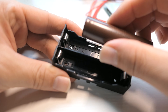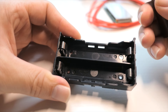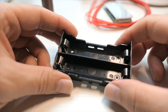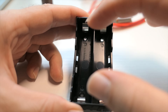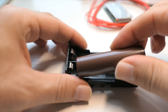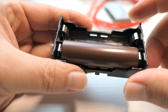When you put your batteries in, depending on how you're going to array them together — today we're concentrating on a simplistic straight-line design so it's easier to understand how the batteries go in series. One thing you don't want to confuse you is the little plus and minus markings on the bottom of the holders, because if you're using these holders those don't mean much. You need to visualize where the negative and positive are on the battery itself.